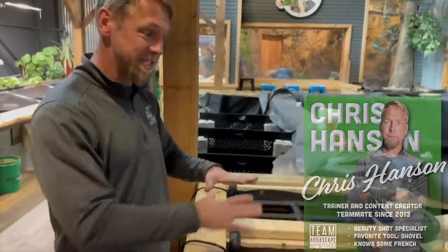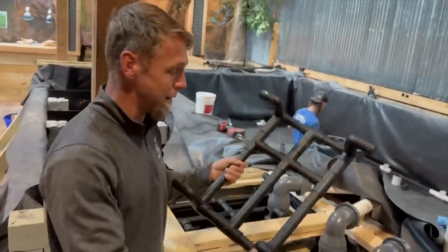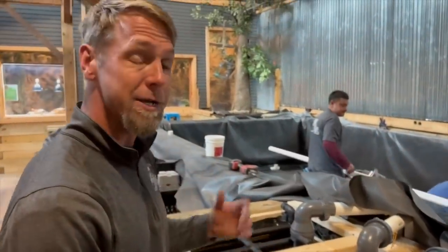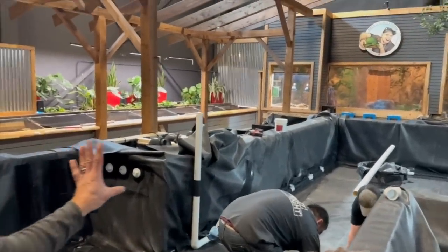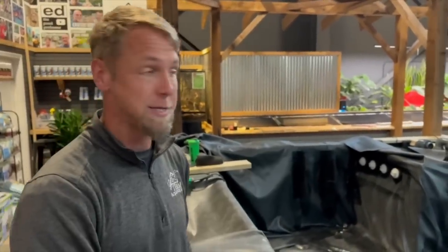A huge update here inside our fish retail area at Aqualand. The guys have now finished the intake skimmer area, got the pumps installed, and all the plumbing has been daylighted. They also made some really cool racking for aquatic plants. Now the energy is being focused on taping down all of those funky liner folds on the straight walls, as well as putting in the circulation jet system. They're running a two-inch trunk line all the way around the perimeter of the pond, occasionally running tees where we're going to have three-quarter-inch lock line shooting straight up. They're also putting cover tape down to disguise it and tape it down on the liner, pushing everything up to the top so it gets drawn into that skimmer intake area.